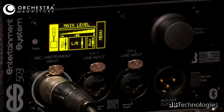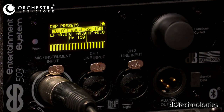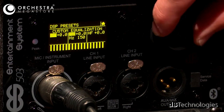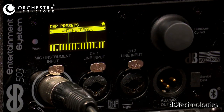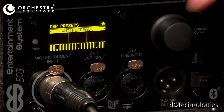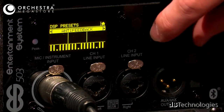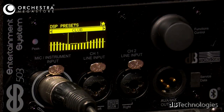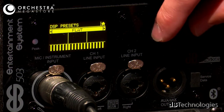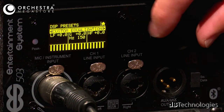One last thing to cover is the advanced settings. The system offers different voicings for different types of applications. Going into DSP presets, you can choose flat, or select different EQ types such as anti-feedback — useful if you're concerned about feedback between the microphone and speakers. There is also custom EQ, giving you access to each EQ filter individually. Other options include monitor mode, vocals (which makes vocals a little more present), and club mode, which hypes the low and high end. There are quite a few different options for voicings, and the advanced setting gives access to every EQ filter.